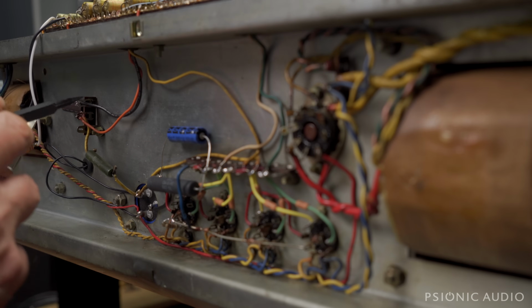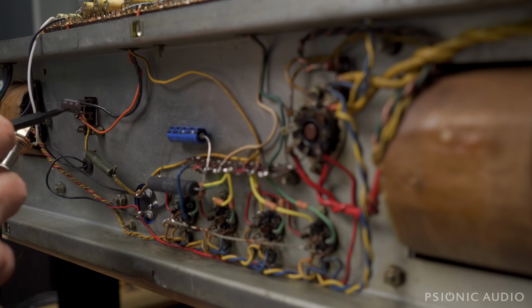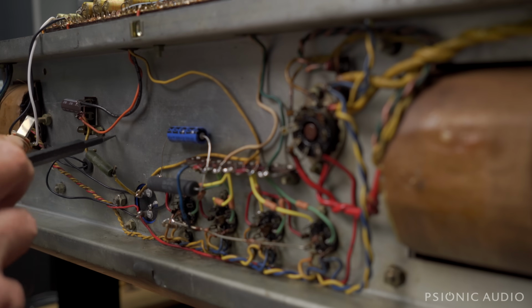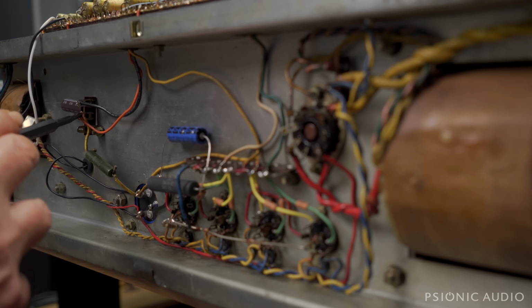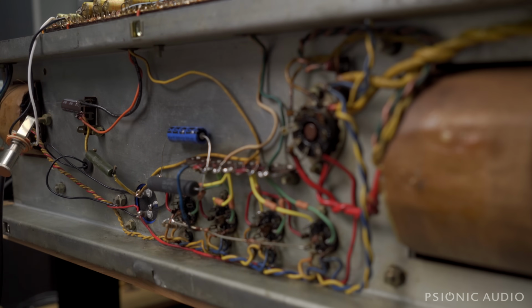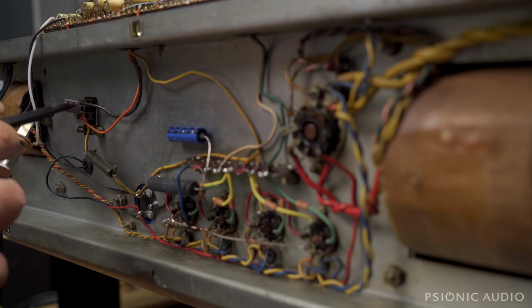And down here, where they had that axial cap kind of fragilely connected from this point over to here, I have a new Nichicon 10,000 hour, might be 12,000 hour, 105 degree rated cap. It's very, very small. It's just 33 microfarad for 100 volts. And I mount it to this terminal strip here with some silicone. It's not the kind of suspended in midair axial. And I have the positive here where this resistor comes in and the split goes off to the other preamp stages. And then I have the negative here, but its ground wire is going to the preamp ground section in the main aluminum half of the chassis. I like to keep all the preamp grounds together and just have some grounds made here in the power section. And that has given us a much more stable connection there.